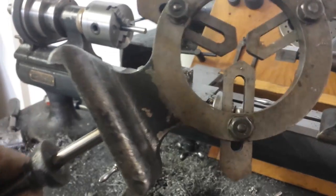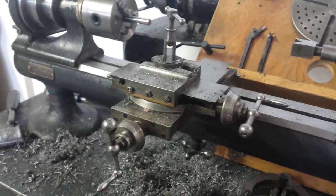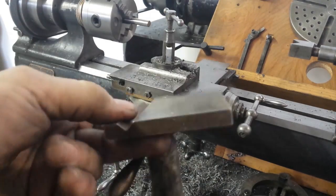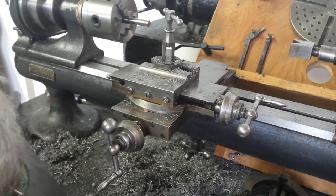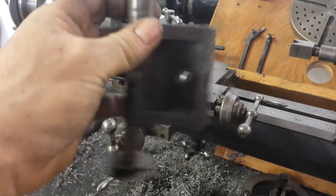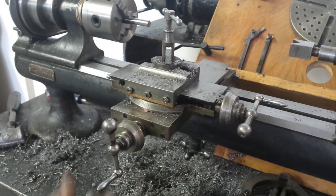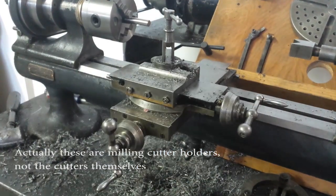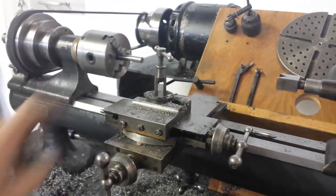It's got a really nice, almost unused steady rest. It's got a face plate cover and the offhand or manual tool rest for the typical watchmaker's use. There's the milling cutter holders and a neat little drive system for, like, a grinder. It's got a whole bunch of milling cutters — I think there are four of them of different diameters. They fit the tailstock. And then it's got some other miscellaneous stuff, including the outside jaws for the 3-jaw chuck.